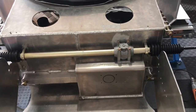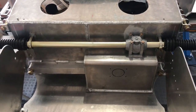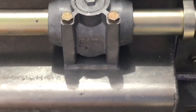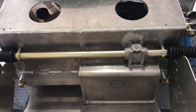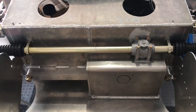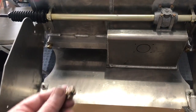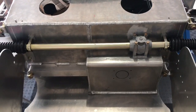The holes came out really nice — I'm glad I took the steering box off; that long bit flexed quite a bit. I've tightened up the steering rack — not torqued down yet since I may re-drill those top holes after having them welded. The rack fits together perfectly. The machined plate fit like a glove and the steering rack is rock-solid. Those top two holes are only an eighth of an inch larger than they should be — it may turn out to be no issue. I also switched to bolts with integrated washers on the pillow blocks to increase clamping force, which may overcome the slightly wider top holes.